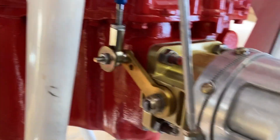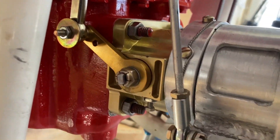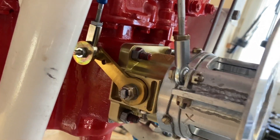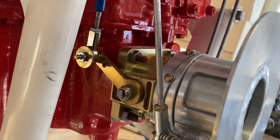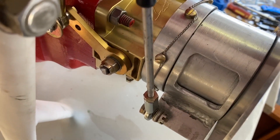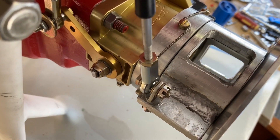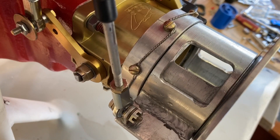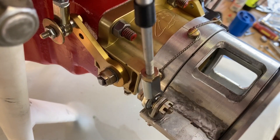You can see the cold air valve there — I'll see if I can get that to open and close for you. If you're not familiar with it, this is to allow cold air — alternate air — for the engine if the filter were to become plugged somehow with fog or perhaps some ice. Hopefully we'll never see ice with this airplane. That all worked out quite well.